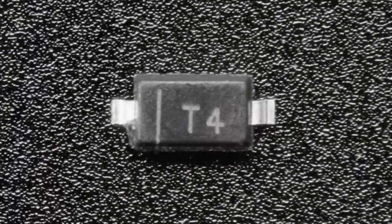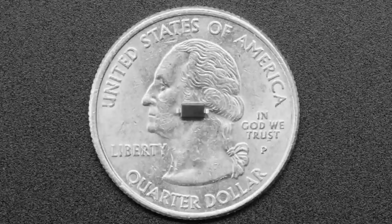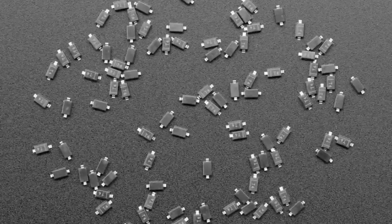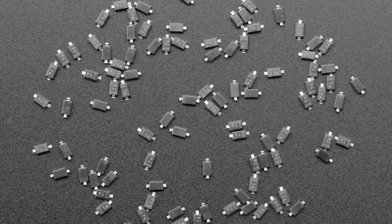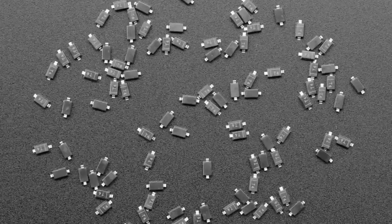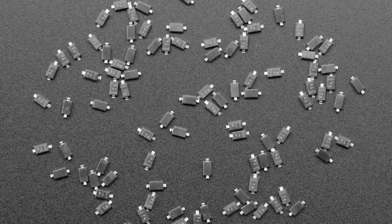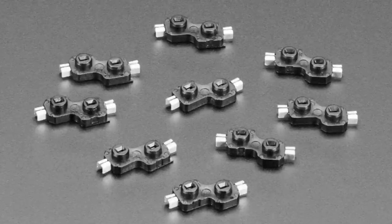Next up, some diodes. People are making keyboards and macro pads, and a lot of projects have diodes in them because they're diode-matrixed. Some people asked if we could stock SMT diodes, so here you go — it is 100 SOD123 1N4148 signal diodes. If you're putting together a PCB with some of our keyboard stuff, oftentimes the only things you need are the keyboard PCB, which you get made, the switches and/or sockets, which we stock, and now diodes.